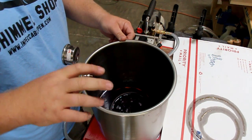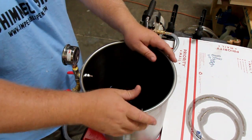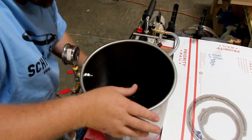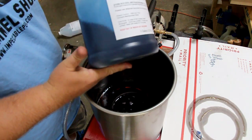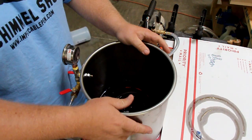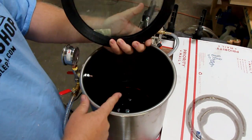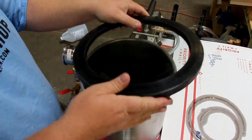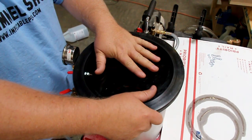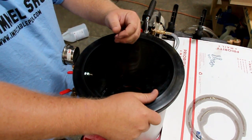You want to have at least a good inch or more of resin on top. Typically I'll put a lot more in because I tend to leave the wood in the pot when I'm not using it, unless I want to switch to a colored resin — like this one here has blue. Because this is a metal pot, I haven't found it hurts it at all. You have to have a glass top or a chamber made specifically for stabilizing resin. If you use acrylic and the wrong kind, it'll essentially waste away — the resin attacks it and the fumes just crack it to pieces.